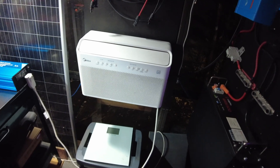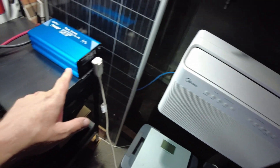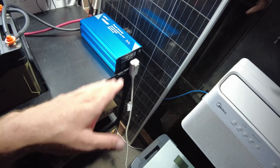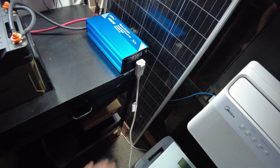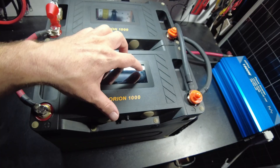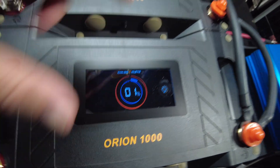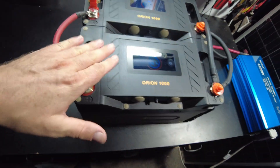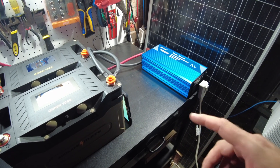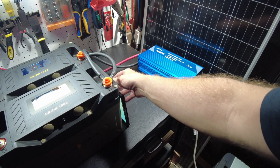The test is complete. I went ahead and shut down the AC and the inverter because we did hit about 10.5 volts, and that's when the inverter starts to complain and starts beeping. Technically we are still showing one percent on the batteries, so clearly there's a little bit of power still left in here, but it wasn't quite enough to keep the inverter from complaining. So we went ahead and shut down the test.